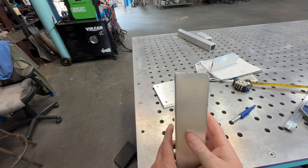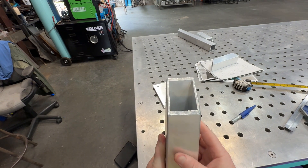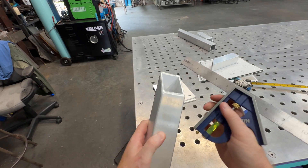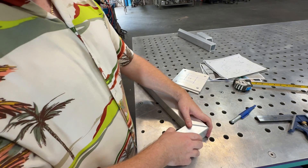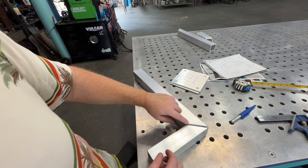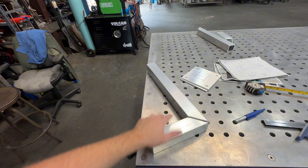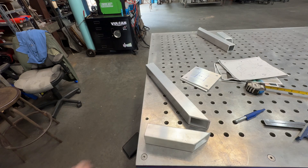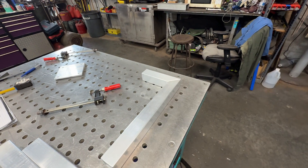We don't need to do that here. Now these tubings are not cut super straight but it'll still work. It's kind of off, but if I lay it down I can still make it square and for what it is it's fine — you can see that gap there, a little big gap. What I did first is — they were already deburred — but I put a little bevel on it because it's a little thicker, and I washed it off with some aluminum cleaner.